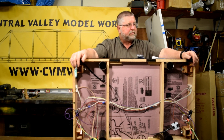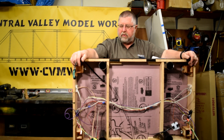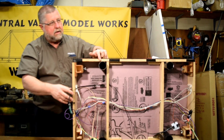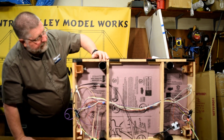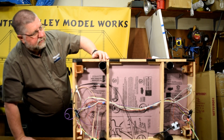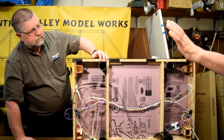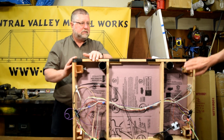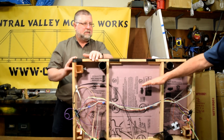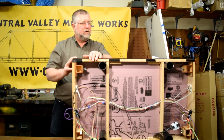And the four bus wires running all the way through, we added the bus wires. Unmolested, so to speak. The bus wires that go from end to end. And something you said that just dawned on me, at the end, you're using a crossover cable at each end to connect to the next module on either end, which then gives you odd numbers of crossovers. Yep. Crossover cable, crossover fitting, straight cable, straight fitting, crossover cable. Three crossovers, odd number. Yep.